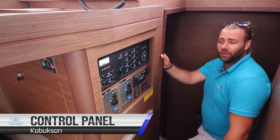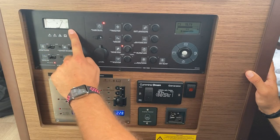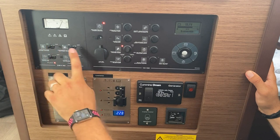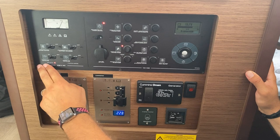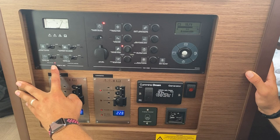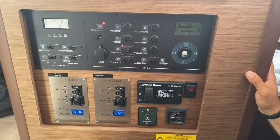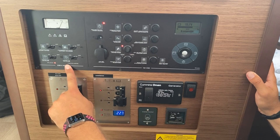The main control panel is located here on the starboard hull steps. Here you have your voltage for your battery house system, the water heater, and the battery charger. These two switches are for the AC plugs throughout the boat. If this light is showing, the AC power is connected to the shore. If this light is showing reverse polarity, there is a problem with the power on the dock and you need to check with the dock staff. It is not a problem if this is running — the system will manage it.